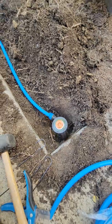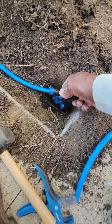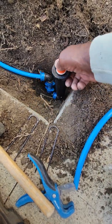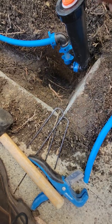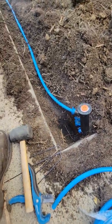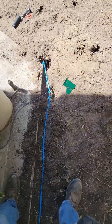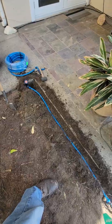The adjustments and flexibility we need — it's a lot of flexibility when we use the Blue Lock professional irrigation system. I can make my height adjustments based on the sidewalk since the pipe is flexible. If I need to move it any direction, it's a lot more flexible than dealing with PVC pipe. Eventually I'll take a landscape staple and anchor it right here to stabilize that head so it won't move around, then put the dirt back over the top. This retrofit is very quick rather than gluing and using PVC and waiting for the glue to dry — the flexibility of this Blue Lock system makes it worth the extra money.